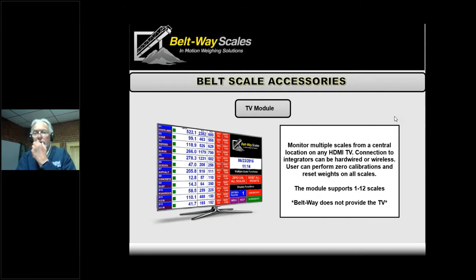Question: can you change products on the screen while running over the belt? Yes, you can do that. In the TV module software you can keep track of different products — there's a little dropdown where you select product one, run it, then switch to product two for a different product. With the scale integrator itself you can reset the total and run a different product, but it doesn't really tell you what those products were. On the remote display, yes, you can keep track of multiple products.